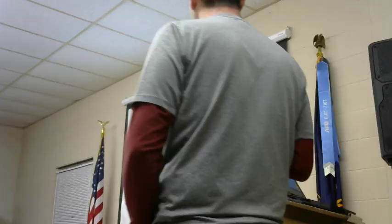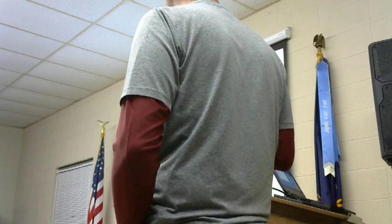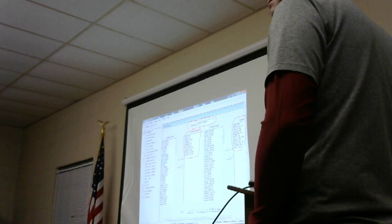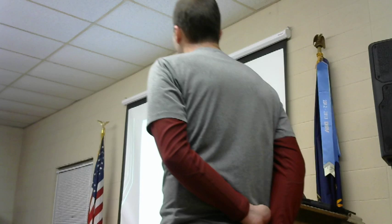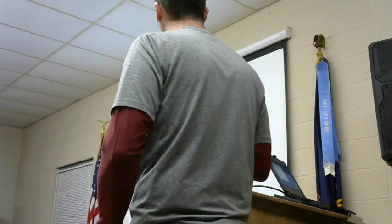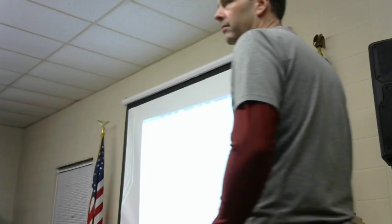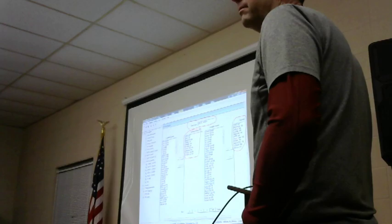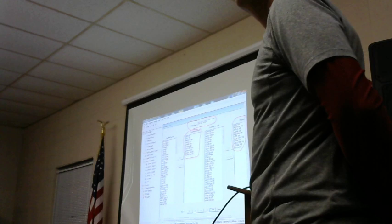And this is the dual band version. Heather, you might be more familiar with this. This is what the 2017 and 9600 mobiles look like. You have your A side and your B side of your radio. For anybody with the dual band, if you want to make sure it will work on both sides, put your channels in both slots. Because if you don't have it on both sides, you won't be able to use it on both sides. The way I'd set mine up is A side with analog channels for the region I wanted to cover, and B side digital. It's kind of like some of the older dual band mobiles where you could only do one band on one side and the other band on the other. You don't really have that limitation, it's limited to what you put in it. Like a VFO A/B. Pretty much. Okay, gotcha. That was always annoying, too.